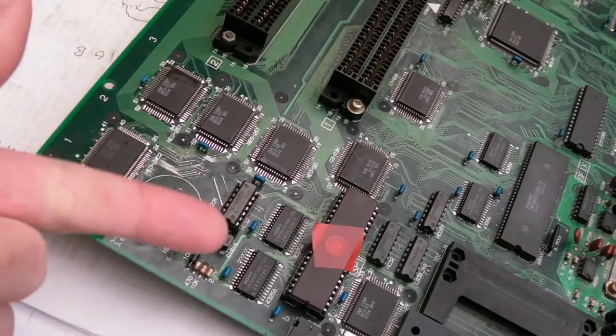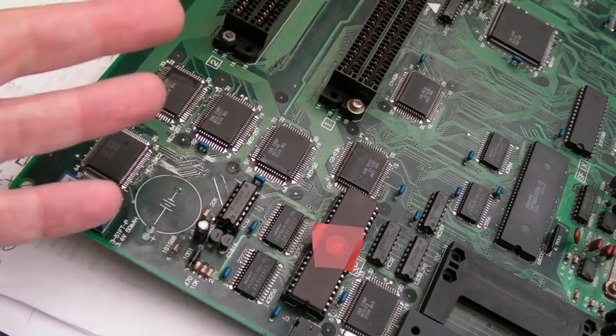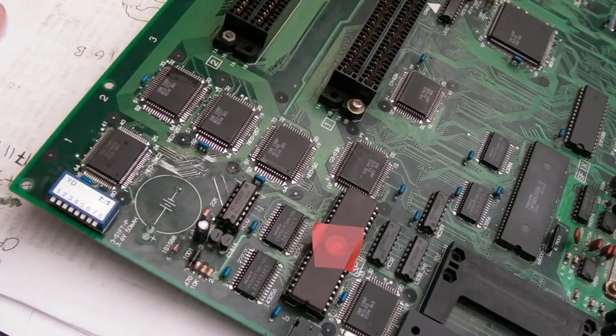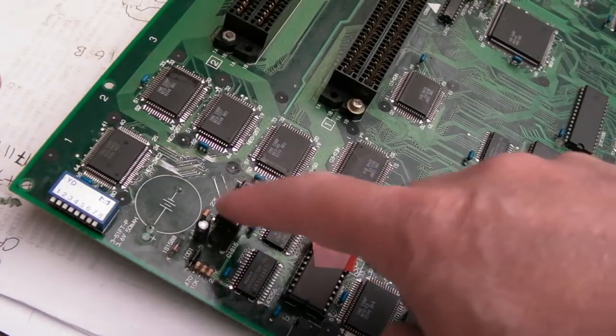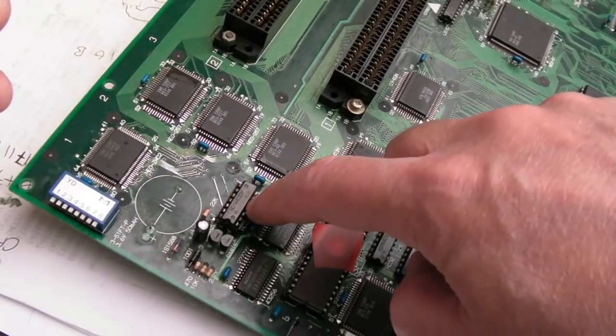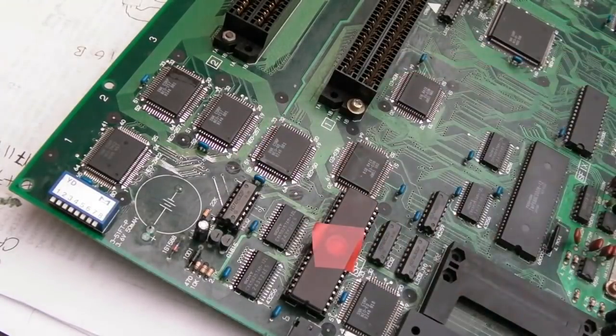Now the good news is we no longer have the graphics faults, the sound fault is a non-fault, and the real-time clock is working, the 4990. There's no calendar error as a result of fixing around here. It was probably some conductivity around these pins here, maybe. Or one of the things I've reflowed there. So it's really weird, but the problem is gone.